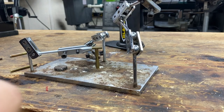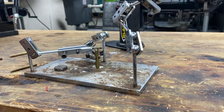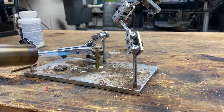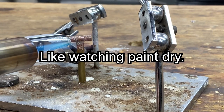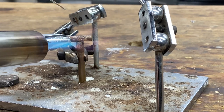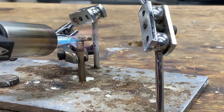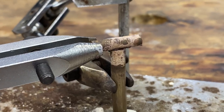Now our next thing to do is to get some flux happening. I like to put it on my brazing wire and apply it to the parts — pretty solidly coated. So we're going to start with this blazer torch, freshly fueled. We are getting some heat movement, and I'm just taking my silver solder and putting some flux where I'm going to want this to go. It appears that our heat has topped out — we don't actually have enough heat from this torch. We're going to call it.